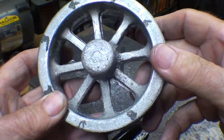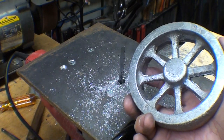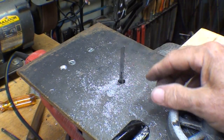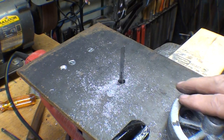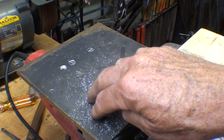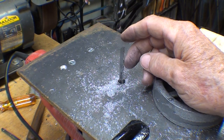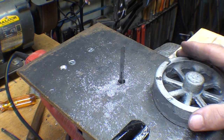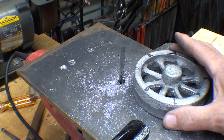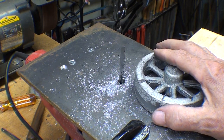That concludes this rather crude lead casting preparation for machining. I'll finish up this one and then in the next video step over to the lathe and drill and ream this and machine it as well as the other one. The jury is still out on this — it's so flexible, and one of the biggest faults is the chuck in this Milwaukee jigsaw has such a narrow slot it will not accommodate a series of these blades. Ideally I would have liked to use three or four side by side to form a file and make it more rigid. I consider this a semi-failure — this is Tubal Cain saying so long for now.